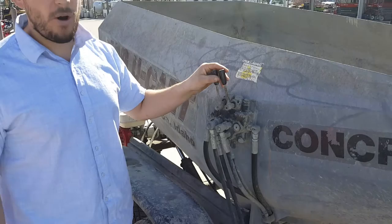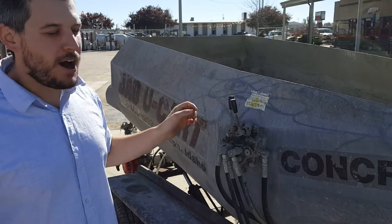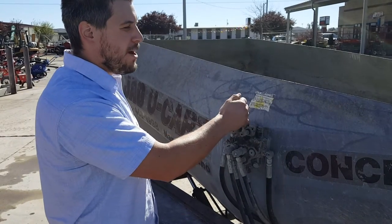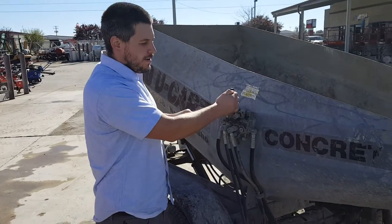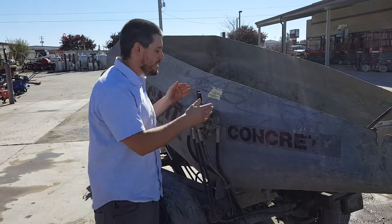When you're going to want to pour into your wheelbarrow, you're going to want to turn off the paddles. The reason being is you're not going to have enough power in the hydraulic system if you do both at one time. So you're going to want to set up everything, turn this off, main controls ready to go, push down to go down, pour out your concrete. Don't go too fast, otherwise there's too much pump — your wheelbarrow will be full and you can't control it. It's a disaster.